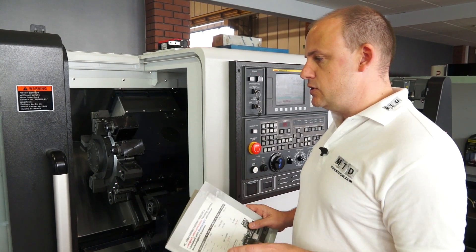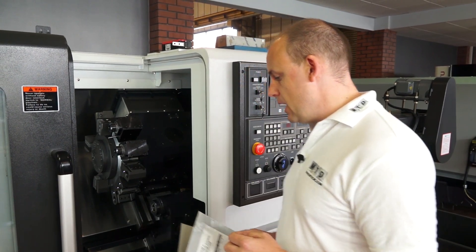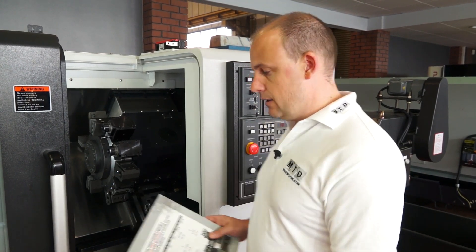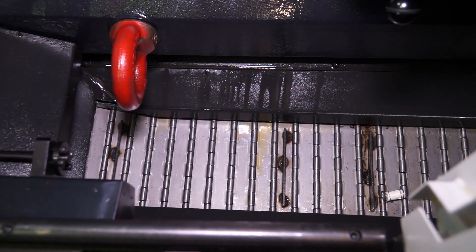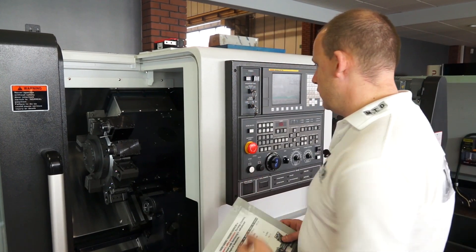The options that come with the machine include a tool setting arm, and this machine actually has a collet chuck inside. When we look at collet chucks, we're looking at more production-oriented use — it might have a bar feed added to it, so if you're doing long-running production components the machine can handle that. We've also got a parts catcher and a parts bin, so when a part is finished and parted off it goes into the parts catcher and then the parts bin. There's also a swarf conveyor for extraction, so rather than having to climb into the machine, swarf is extracted to the right-hand side.